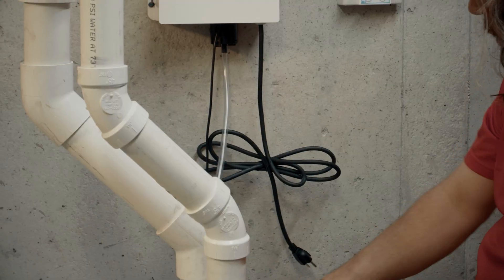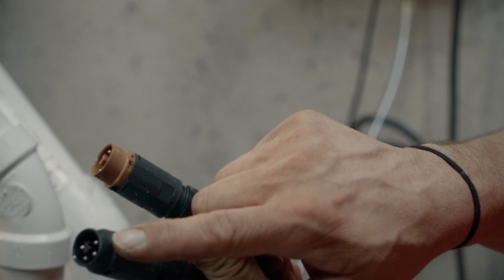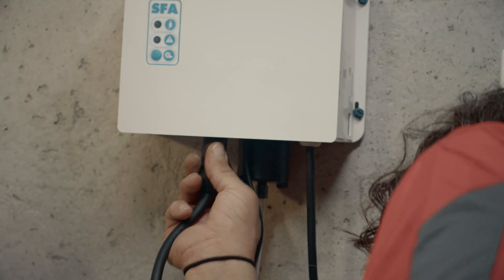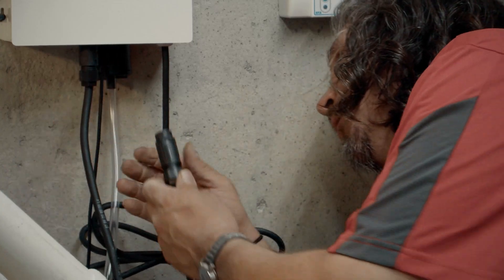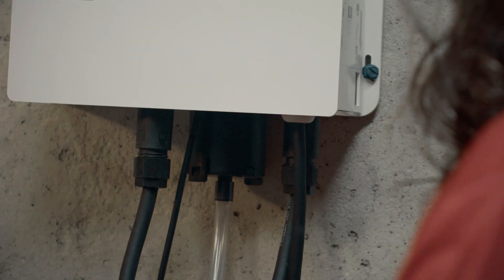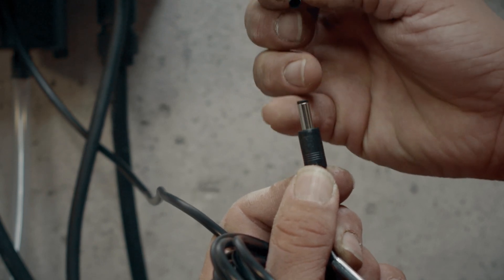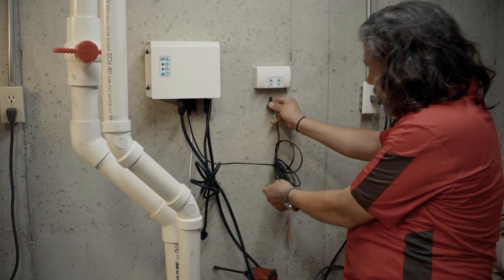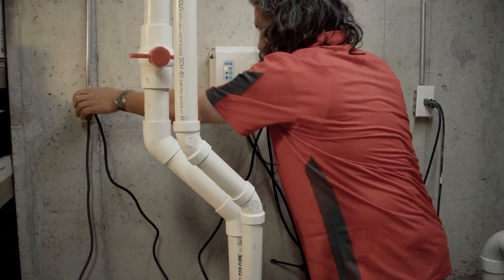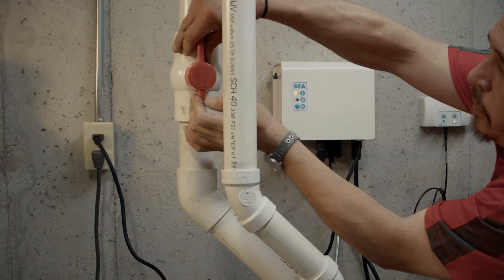Slide it on the end. On the cables there is a brown end and a black end, with corresponding spots on the bottom of the control box. Plug them in accordingly — they are one directional so you have to make sure they're in the right way, and then they click into place. Take the protective end off the alarm cable, plug it into the alarm, and then plug in the unit. Power's on. Open up the valve and test.